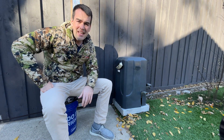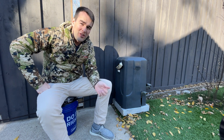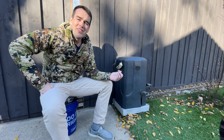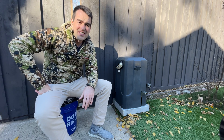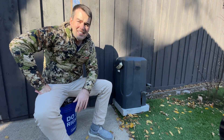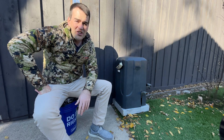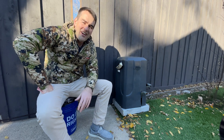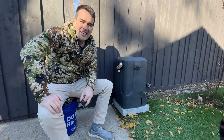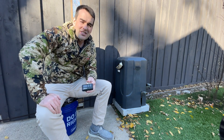That's how you get your Ramset gate opened with the RAT GDO Rage Against the Garage Door Opener. It'll work for a lot of 24-volt systems — gates and garage doors. All this is is a pretty basic 24-volt garage door system going sideways instead of up and down. I think the RAT GDO is great for this. I like it more than the Shelly because I've got two limit switches instead of just one. This could work as a very basic tutorial for a standard dry contact opener for the RAT GDO.